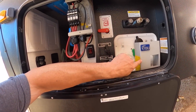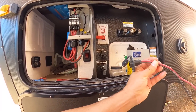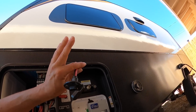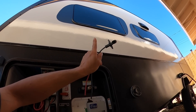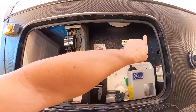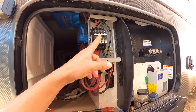I still got to put the cover on because I haven't wired this yet. This is for so I can put some panels on the ground outside, because we have like seven panels from our Class C that aren't going to fit on the roof — there's just no way, and there's already a 190-watt panel up there. All I have left is to run some wire from here, just around and into the box. Everything's ready to go — I just need to run the ground and the hot through here and that's it.